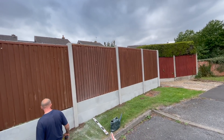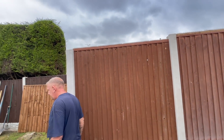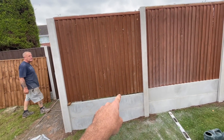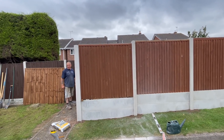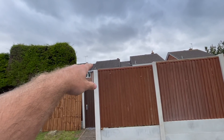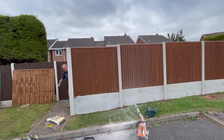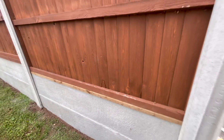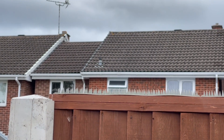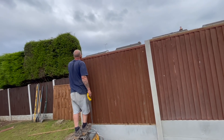We're back - a little change on this job as well. We've done two straight, gone with the ground. The panels were looking nice and neat at the top but the customer has asked us to put a baton underneath to make that drop, and then have the panel above the post - the customer gets what they want. We'll take it out, put that baton at the bottom, and then he wants us to saw the top of the corner off in a chamfer style. Not 100% sure how that's going to look, but that's what they've asked us to do. So we've put a baton on the bottom and secured it all together - you can see the panels are now above the post by a baton. We're going to attempt to chamfer this off as the customers asked.